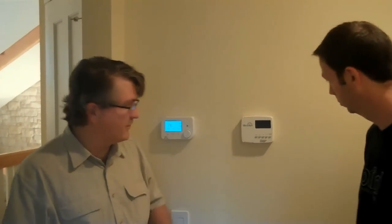I think it's a really good system — I'd highly recommend this if you live in a hot, humid climate like Austin, Texas. One other thing: this unit is also controlling the outside air damper. It periodically opens the damper to let air in. The house is very tight, so we really do have to think about getting outside air. We even have an outside air damper for the vent hood downstairs in the kitchen. It periodically comes on and lets a little outside air in to keep everything fresh, but it dehumidifies it right as it's coming in. We're not trying to bring in really humid, hot air. There is a small energy penalty, but it's worth it. Remember — we want to build as tight as possible and ventilate correctly. HVAC needs a V: that's ventilation in HVAC.